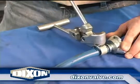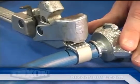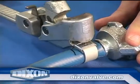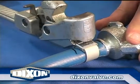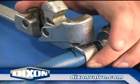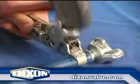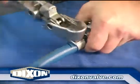Never grasp the knob of a punch tool with a closed fist. If the clamp tail breaks unexpectedly, the installer may be injured. While tensioning the clamp, if the handle will not go to the full-down position without risk of breaking the clamp tail, release the pulling dog lever and lower the handle. With tool handles in the full-down position, strike the punch head, setting the lock. Then break off the clamp tail by raising and lowering the tool.